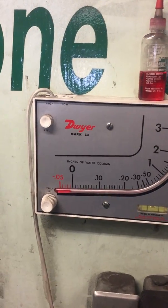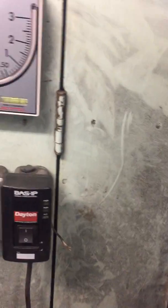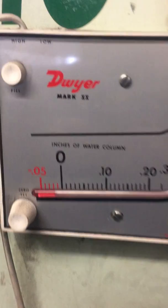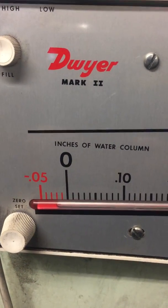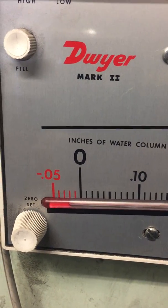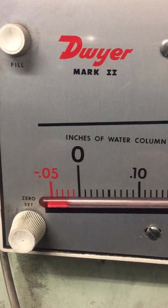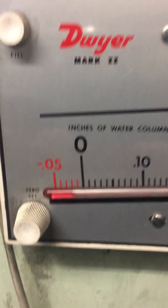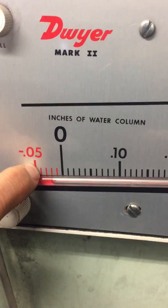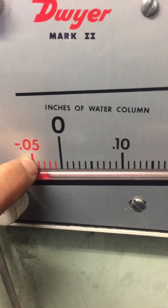Come back over and you can see the manometer — oh wait, I'm stepping on the hose there, that's why. You can see that the manometer is showing a draft of about 0.02, which is exactly what you want with the direct vent. You want to be between 0.02 and 0.03 on a direct vent. If you get up closer to 0.04, you're drafting stronger than you need to, so you're losing heat.